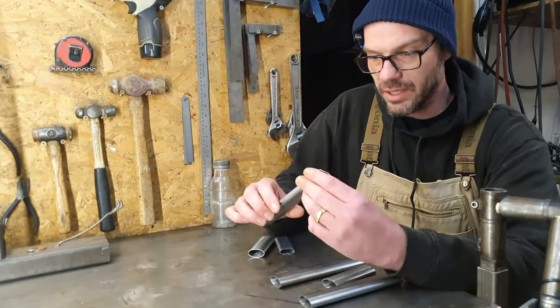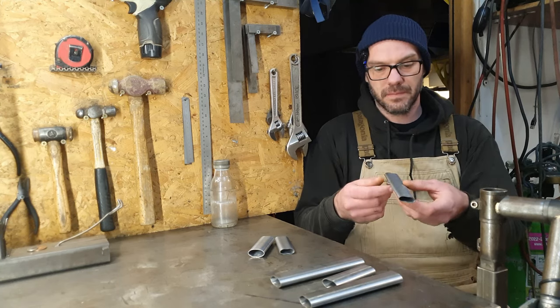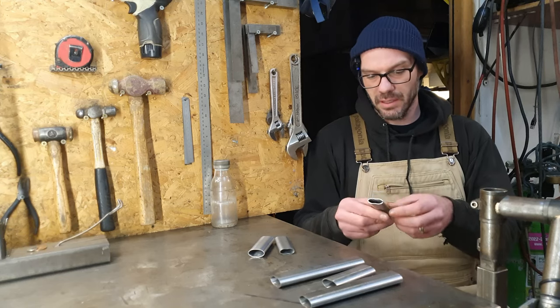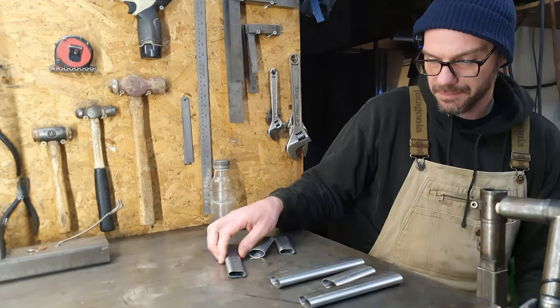It wasn't much success trying that different forming die on the fly press. Shapes come out pretty much just the same. It's not to worry though, like I said, the tube's way thicker than we need it to be for strength. It's just the way that it looks, and also when it's in a complete bike you won't really notice it too much, so I'm just going to send it.